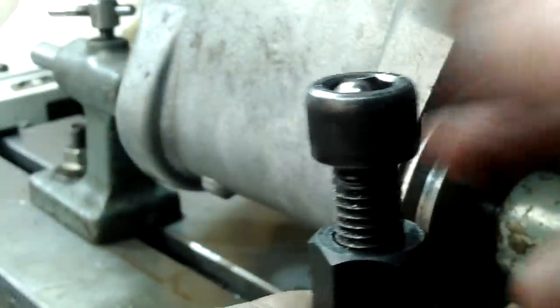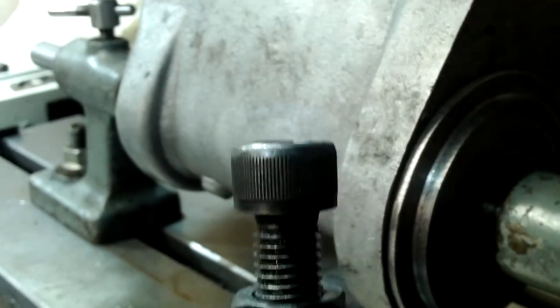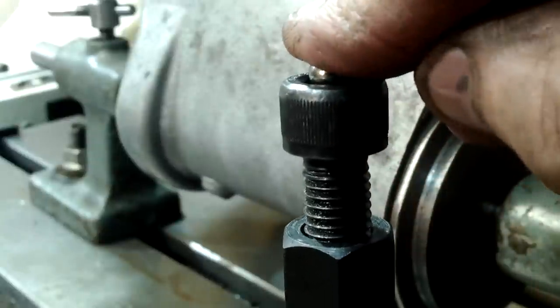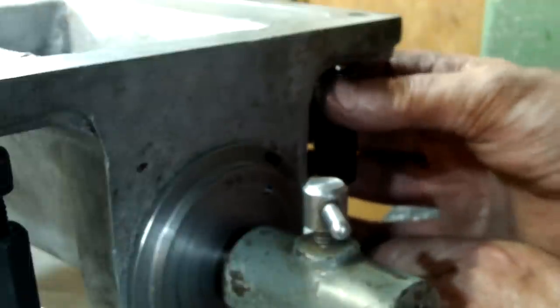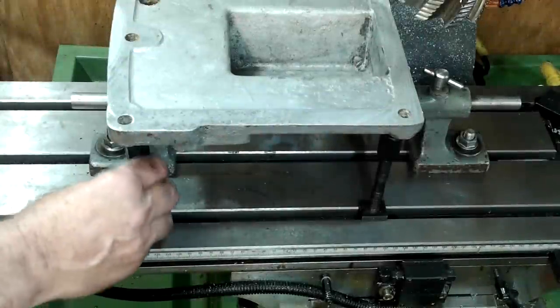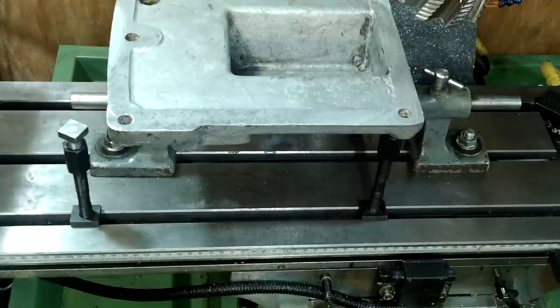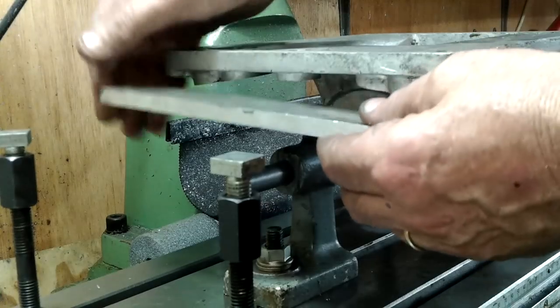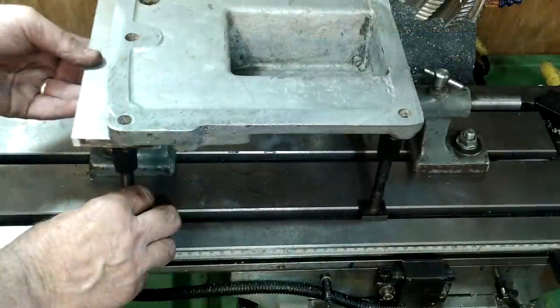The rotational stability came in the form of four hand-tightened jacks. I normally stick a large steel ball in the top of these cap head screws to provide a better point of contact, but sometimes I end up using a hex nut in the top of the cap head screw and then stick a smaller steel ball in that — it does the same job. On the underside at one end the surface is not level as it sports two equally opposed compound angled surfaces. However, with a suitable bit of flat bar the flat-topped jacks remained stable while the skimming process was completed.